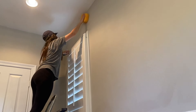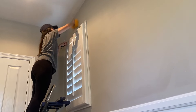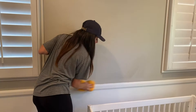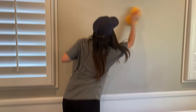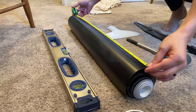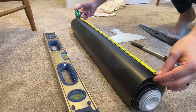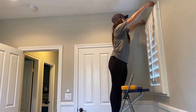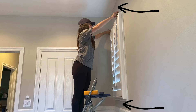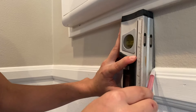To start, we are going to wash our walls with a damp clean sponge. I didn't use any soap, just water, and I wiped down all the walls so that the wallpaper had a good clean surface to adhere to. Then we're going to measure our wallpaper — mine was 25 inches wide. Remember that measurement and subtract two inches from it. So we're going to measure 23 inches and mark that in about four to five places with an x, then connect all those marks with a level. This line will act as a level guide when you hang your first piece of wallpaper.